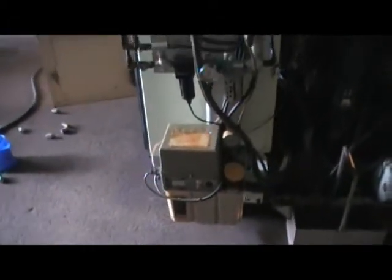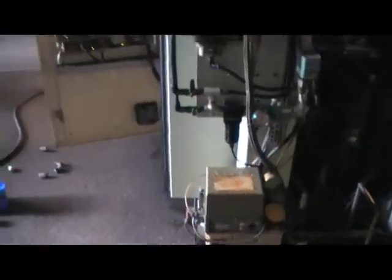And it's got regular air valves for the operation of the gantry loader. It's got the Vogel, a very nice big unit, with lubrication. This is actually the control NC side. This is a PC for it, a Fanuc 0TT controller for it, the I/O boards. This is a Fanuc control for the gantry loader right here. I/O board with all the fuses on separate valves. That's a very good idea.